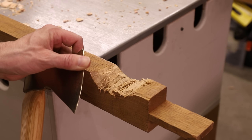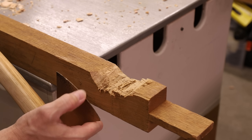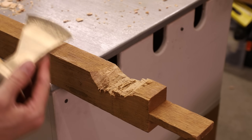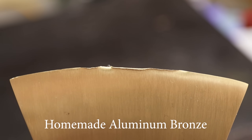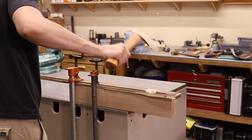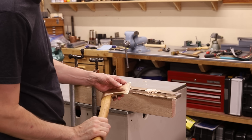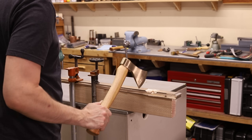The aluminum bronze worked super well also and I just could not be more impressed with these results. My homemade aluminum bronze must have been very weak because both of these easily outperformed it. The last one I made cut through a green tree no problem, but when I started cutting some hard maple it failed miserably. In the last video I cut some maple so I decided to cut some maple in this video also, and they both held up just fine.